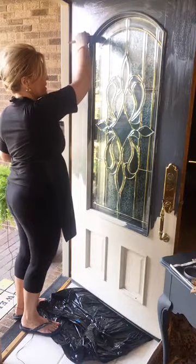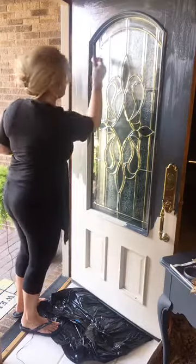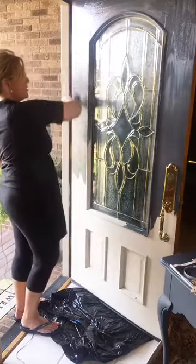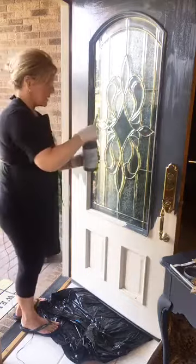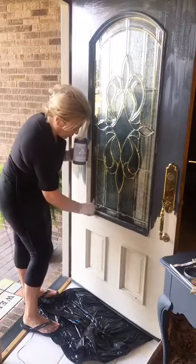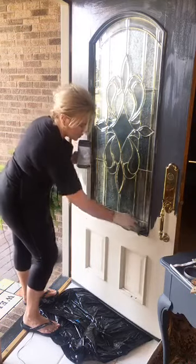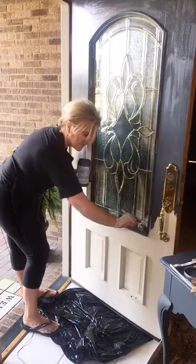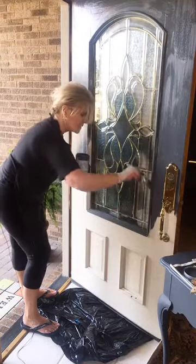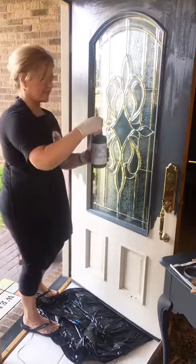So it's going to have a velvety sheen, but not a shine like a latex. It is a non-latex paint, but it's super durable, and it's great for exterior. It's great for shutters, garage doors, your interior doors, exterior doors, furniture pieces. It will distress. That's a question we often get. Can I distress? You can distress. If you want to give this an aged finish, you can always distress it with sandpaper, but you can also distress it once you apply the paint. Just as soon as it starts to lose its sheen, you can easily wet distress at that moment. You can't let it go too far past that. After it loses the sheen, that is the time to get on there and get it distressed. If you pass that point, it gets a little difficult.